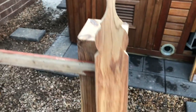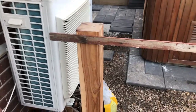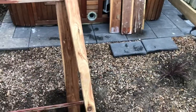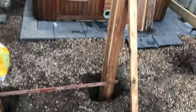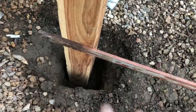Hello and welcome to this Mark's Reviews and Tutorials video. We're going to look today at just a method of how to get gate posts in. When you're putting gate posts in they need to be strong — you're going to have hinging on one side and latching and catching on the other. Gate posts always have to be in concrete because of the hinging and the latching. Other posts, if your soil is good and solid, you can just put them in soil and ram it down with a crowbar. So what we've done here is dug our holes — as you can see there's plenty of room around the poles so the concrete can go down and set them nice and firm.